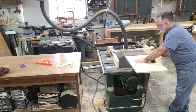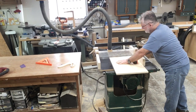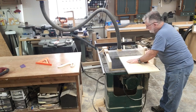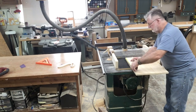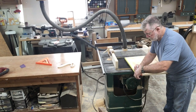It's time to cut the top. The first thing you always want to do is square that first edge before you measure and cut the final length — this ensures that your cabinet will be square as you assemble it. At this point, I'm ready to take the final measurement, mark it, and cut it.